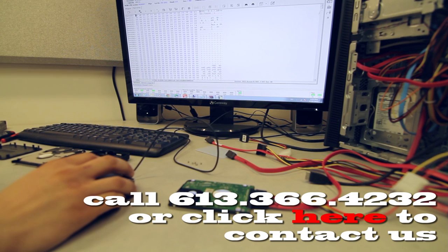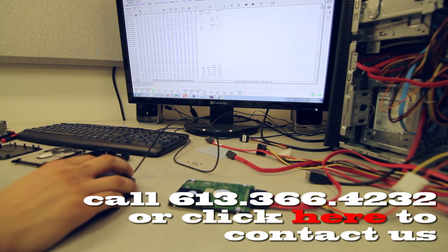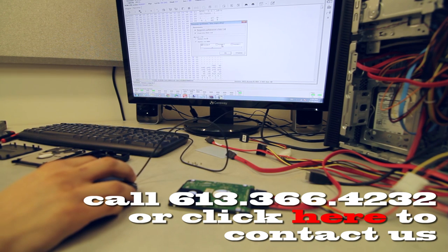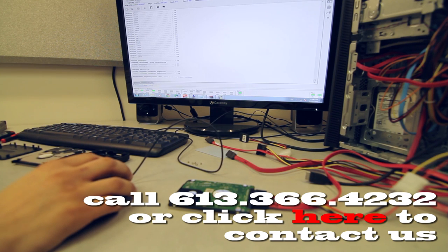If we access this, usually if it's got any entries in it, we would want to clean them up, okay, because that's what most likely has got a slower drive down. So in order to do that, we're just gonna go into the option to resolve it, and we need to put a restriction to no longer be able to write any new entries into the relo list. Okay, so right now it tells us that we need to repower our drive.